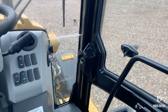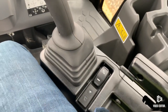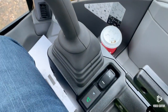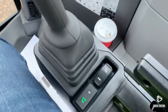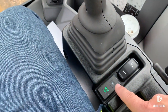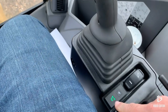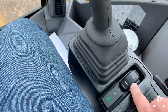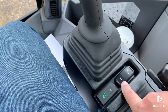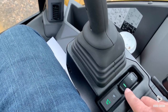Now we got that steering wheel stowed away and we don't get that warning light on the dash. We're going to get spun around to the back end and show you guys this dual mode feature. I am facing the back end of the machine. Right behind the right hand joystick you've got a little indicator and a switch — this is the dual mode indicator and the dual mode switch. Right now the backhoe picture is lit up and the dual mode switch doesn't have illumination in that little white square.